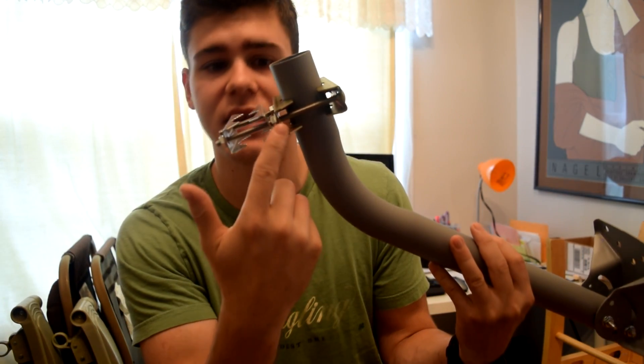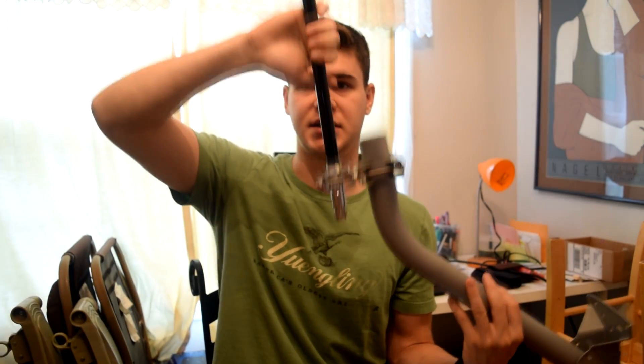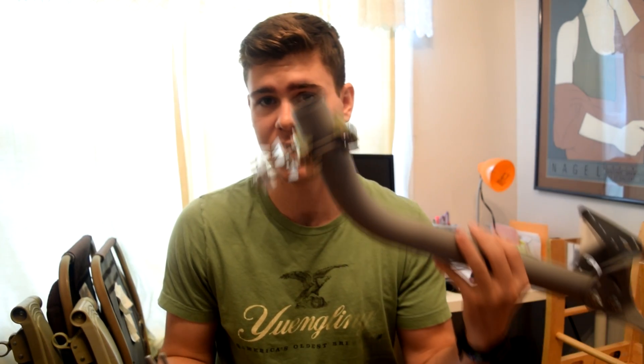You don't have to have a nut in the middle but I do, and then the antenna is going to go in here and sit on the roof like that. This is not the antenna I'm going to be using — this is the 3DBI that I didn't have any good luck with; I'm probably going to return it. I wanted to make note that if you are getting the carriage bolts with this same setup, do not get galvanized bolts, or if you do make sure you bring a nut with you to check if it fits, because galvanized bolts have a coating that makes them unable to thread with a normal nut — you have to get a specific nut to bolt onto it.